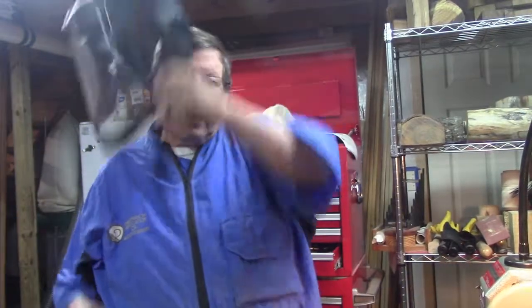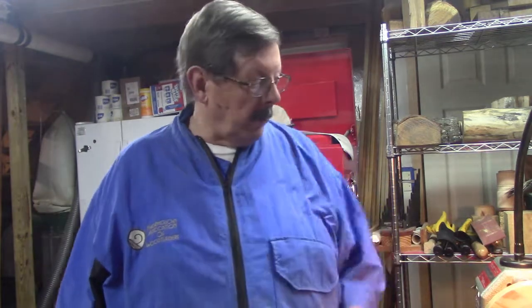Back in the shop. I've really been pondering what I wanted to do, how I wanted to put this on here — whether I wanted to dedicate a face plate, use a piece of wood Bob sent me in the kit, or whatever. I've got a waste block I've used as a jam chuck on the inside of bowls before. It has a really nice face plate on it. But what makes a lot more sense is to cut a dovetail tenon on this thing, mark it, and use this piece of wood as my vacuum chuck. It's just a piece of two-by-twelve, and it's got plenty of space for a tenon.